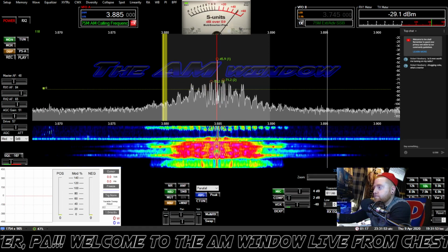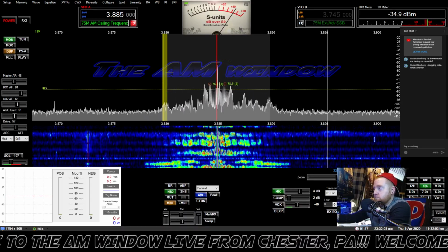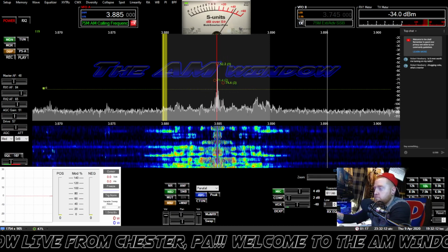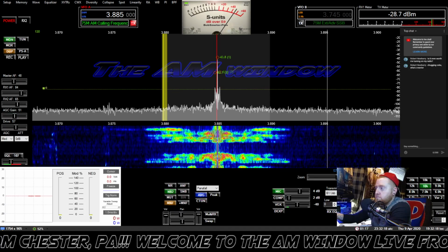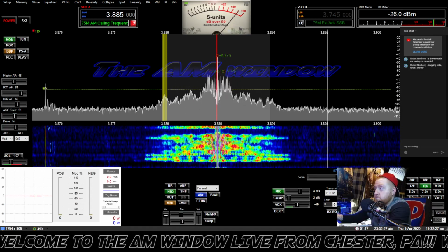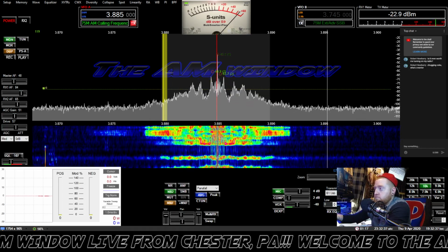Oh, I'm just running a Johnson Viking 2, and that's externally modulated by a solid state Crown audio amplifier, 4-ohm output, and I use a pair of toroidal power transformers, believe it or not, to match the impedance to the 6146s in this Viking, which present about 3,000 ohms, a little less, a little more. It depends what kind of voltage and plate current you're running. So that's the deal over here, and all that goes into a doublet, open wire fed, double balance tuner, homebrew. I've never been able to successfully check into that net though.